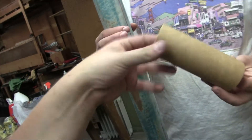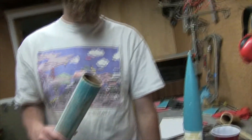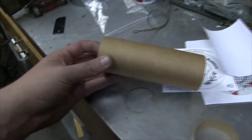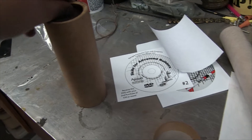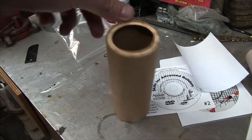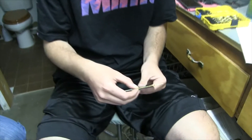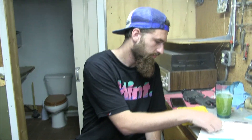What we can do is glue the centering rings in, and then we know they'll be flat, and then cut the tube around the centering ring — just a little bit bigger than the centering ring — and then put the motor tube in there so the fins can still go through. The plan is to cut half-inch pieces of this coupler tube so we have buffers in case we mess up, epoxy the centering rings into those, and use those pieces as centering rings — which gives a little more surface area. We're cutting the fin slots with a Dremel, and we'll drill holes at the front and rear first, then just slice out the rest with the diamond bit.